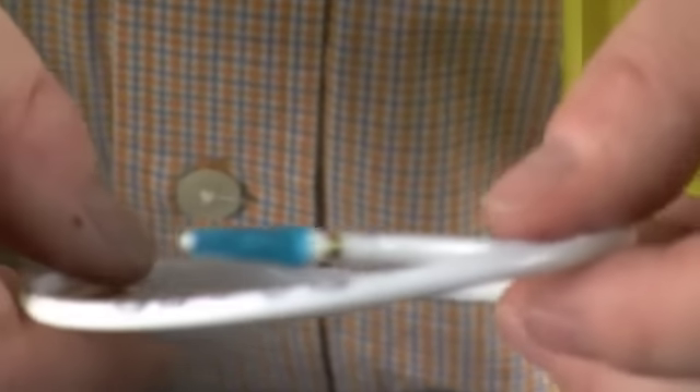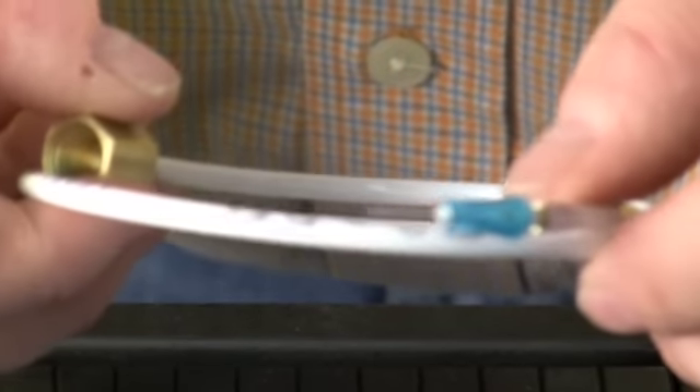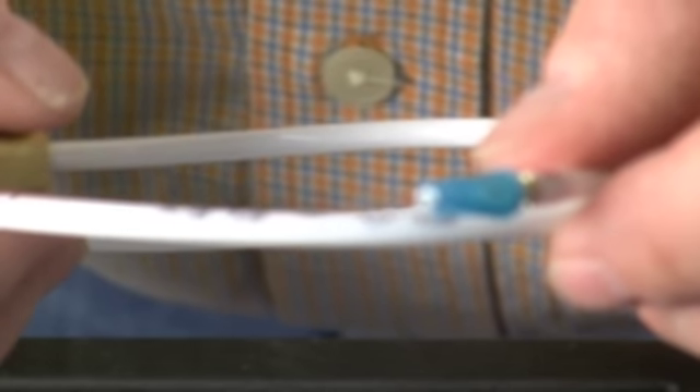In addition to the Johnson screw-on, you also have what's called the hypodermic needle branch pressure tester. It does have a hypodermic needle that would slide in through the orifice on the T-4000 stats. The needles are replaceable, so when you wear those out or bend them, you do not have to replace the whole thing — you can replace just the needles themselves.